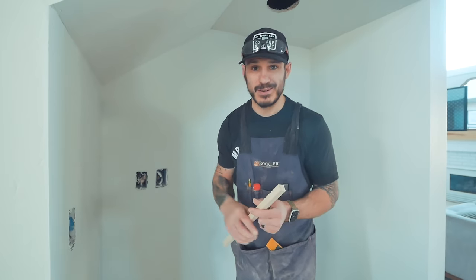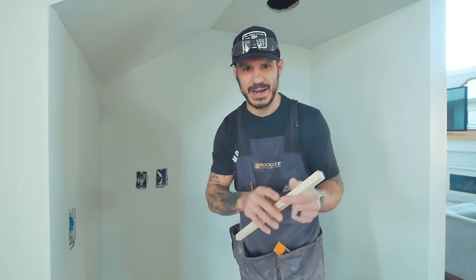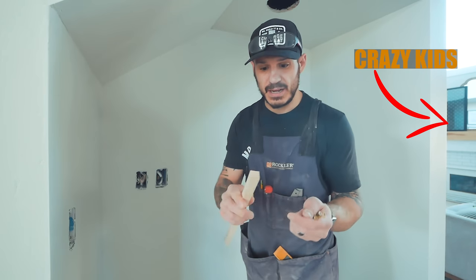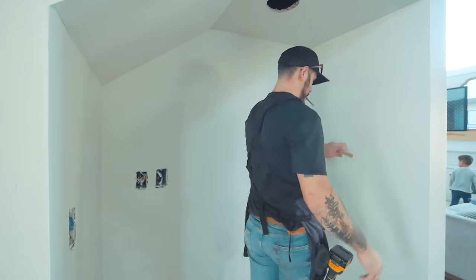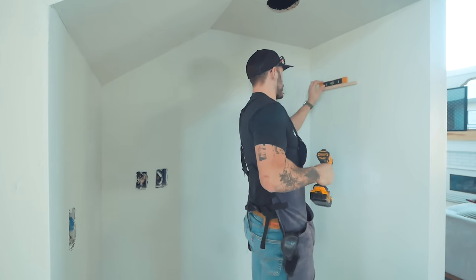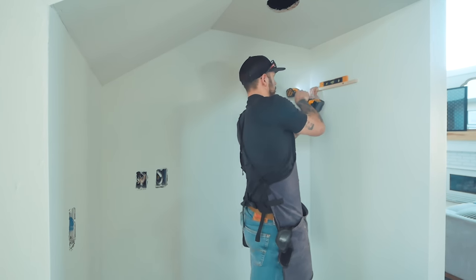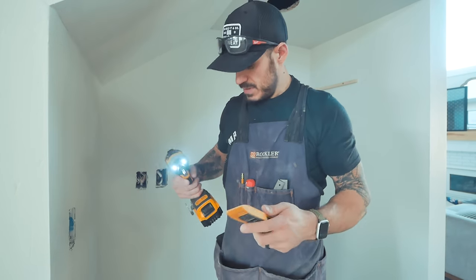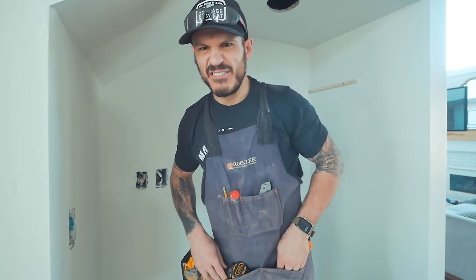So I realized the inside parts that I cut are a little too wide based off the miter. So I end up going one inch or three-quarter inches thick on this. I'm gonna lay those out and I pre-drill these holes so it doesn't snap. It obviously helps if you have a little laser level to mark out exactly where your studs are.